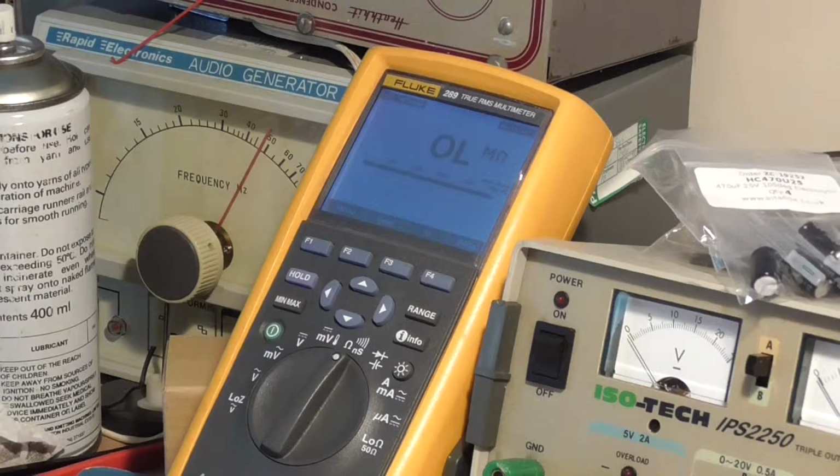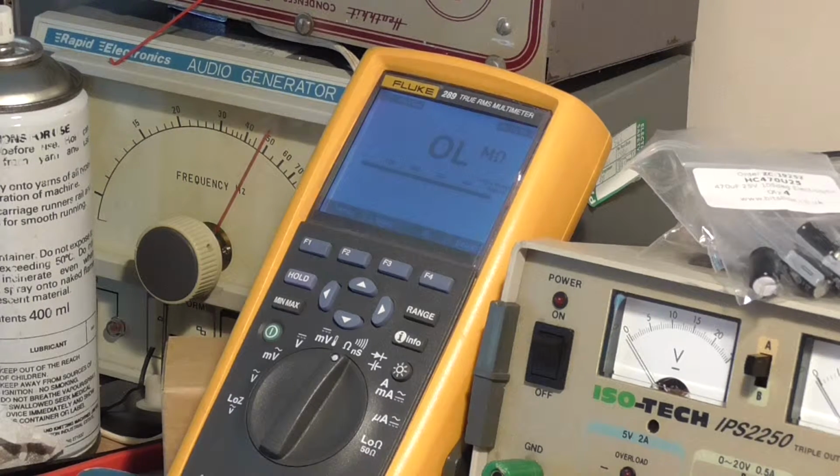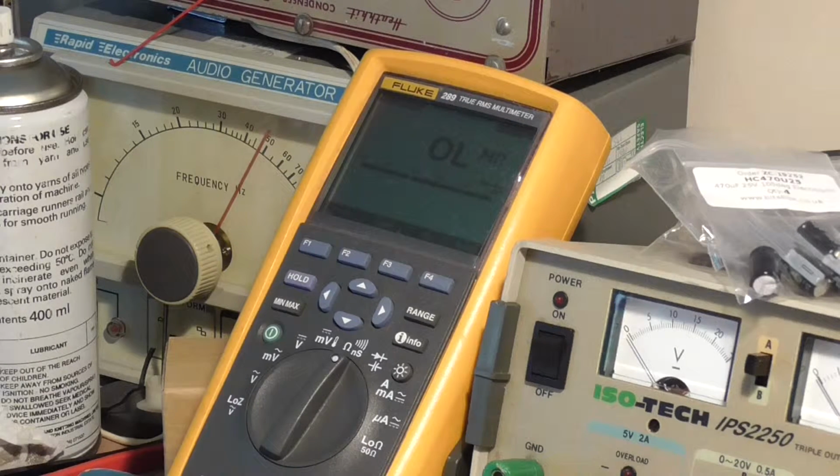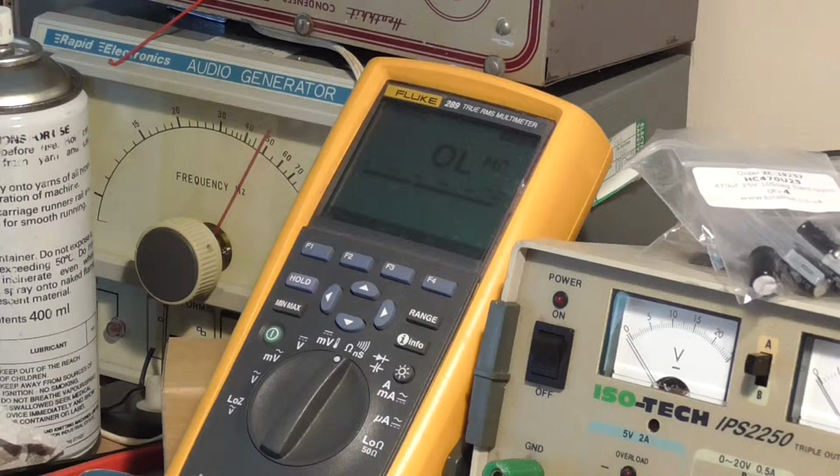Okay, we've now clipped that resistor out of the circuit. So all we've got is one end cut off. So now we measure it, and we've got 203 odd ohms, and that's supposed to be 180. So that's no good, so that's going to have to come out. We're going to use the coil method to get this in here, because there's not a lot of room. I've left a stub one end, and the other end, the stub will be very short, but I'm sure I'll find a way of hooking that in. So what we've got to do is find another resistor, and that's going to be fun, because I've got a bag full. I'm going to go through all of them to find anything like that. So let's do that next.